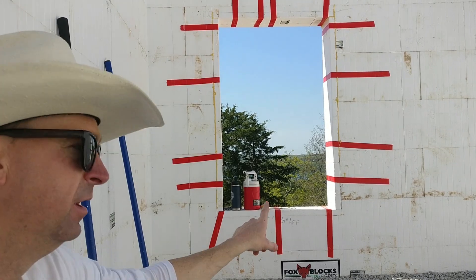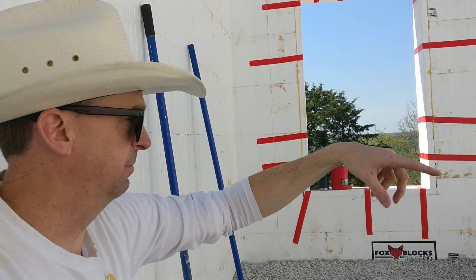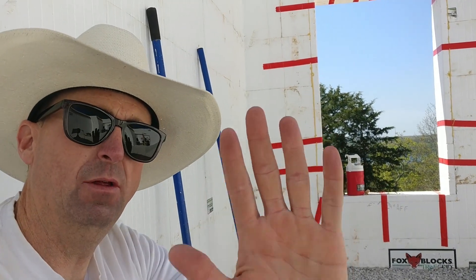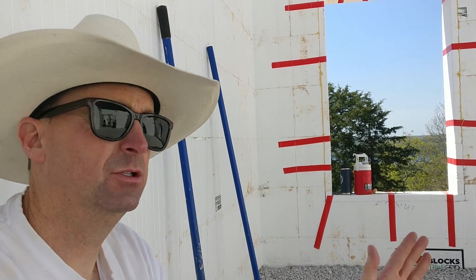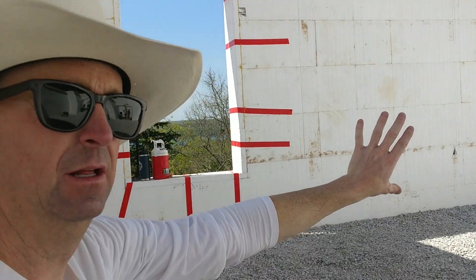The other reason was that this is the lakeside, and we need means of egress to go out. If a bathroom were on this side, you'd have to go through it to exit in case of a fire. So all the bathrooms are on the back side and all the means of egress are on the front side. That way I utilize the most amount of movement in the smallest footprint, with no unused space — no hallways, knockouts, or nooks.